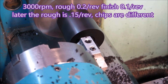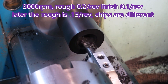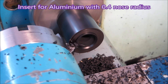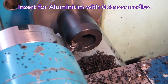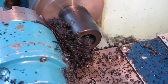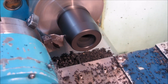Here we're using the 3000 RPM that was actually shown in the software when we were looking at that. I'll end up doing it at 2000 RPM I think, but here I'm running it at 3000. The aluminium turning tool in there actually has a 0.4mm nose radius, and later we'll end up using a 0.8mm nose radius trying to get a reasonable finish on these things - it doesn't have to be wonderful, but there's something about some people that just makes them want to try and make things look the best they can. I suppose it's a bit of an affliction really.